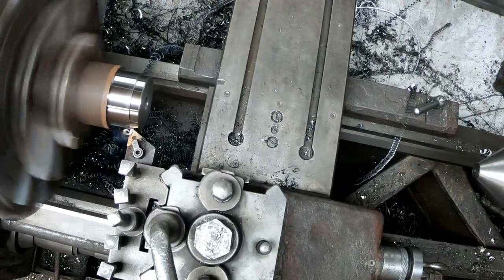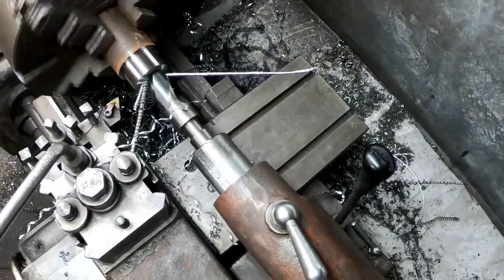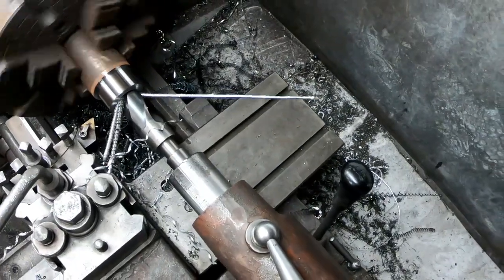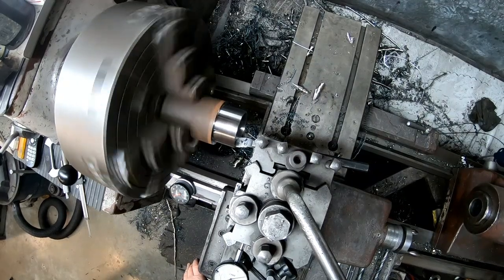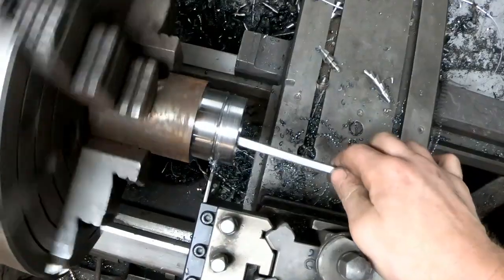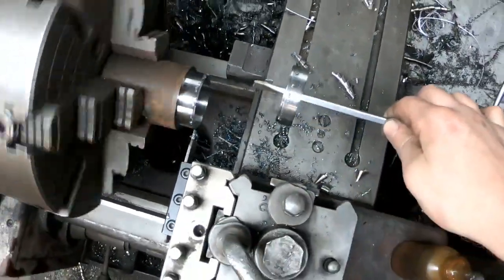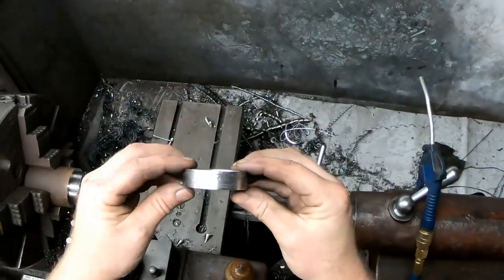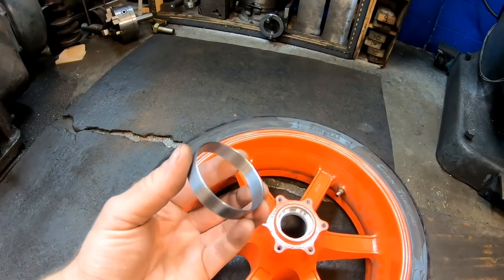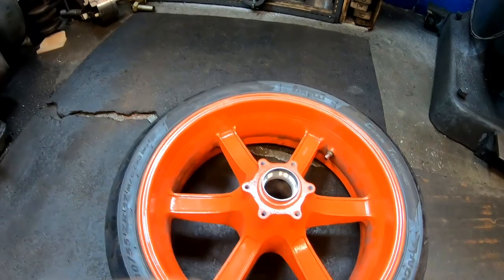My choice of material for these repair sleeves is going to be 4140. And this is a chunk of an old arbor that we replaced in a previous machine we built. And this has really good machinability and wear and weather resistance, so I thought that it'd make a good material for this sleeve. And there we go. We have one repair sleeve. Well, here's our beautiful little sleeve, but we're gonna have to make some sort of an install tool now.